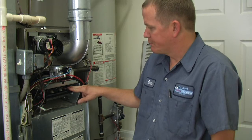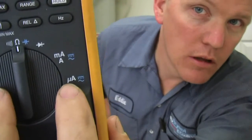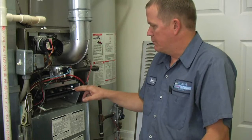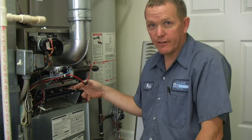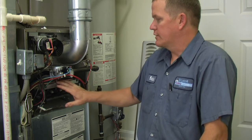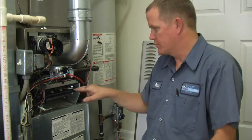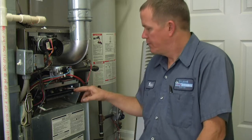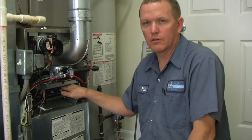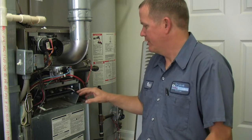On the other side is the flame sensor. You need a meter that will read microamps to test it and make sure it works right. What a flame sensor does is pick up ground out of the fire — fire will carry small amounts of electricity, very small amounts. The burners are connected to the burner box which is grounded to the furnace. The flame sensor hangs up there by itself, insulated with a ceramic piece. When the burners come on the fire touches the burner and hits that rod, which picks up that small amount of electricity and sends it back to the circuit board, telling it the fire is going.